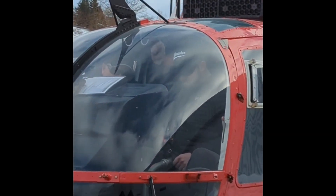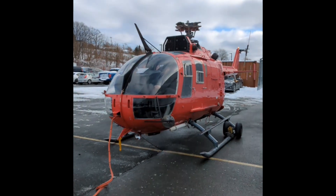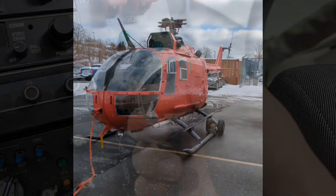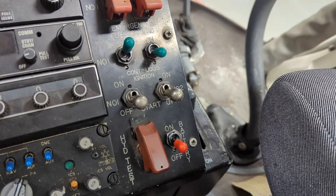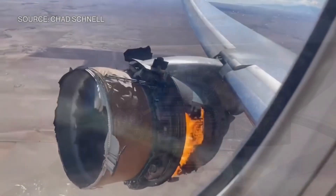Usually we would be watching N2 to see our rotor speed. However, with no rotor blades attached, N2 is going to be abnormally high. When N1 RPM has reached 58%, disengage the starter and continuous ignition. If N1 has not reached 58% after one minute of continuous starter use, abort the start so you don't cook the starter.